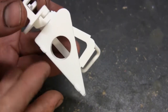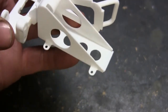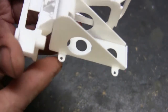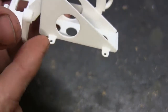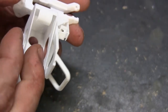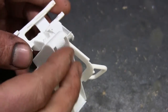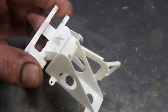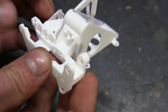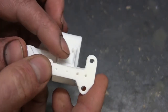The geometry is as per the real unit — note all of the perforations found for weight savings. We have these two tabs which look to be some kind of mounting tab, but I have no idea why they're there. But they're on the real one, so they're going to be on this one. You can see the weld beads present, and again, this is true to form. What's really cool is this little round section here, which has to do with the way the ammo can fits and secures in place. The ammo can is secured to the cradle mount via this bracket, which would be CNC billet aluminum on the real unit, and here you get to see all of those CNC type cut marks present on the piece.